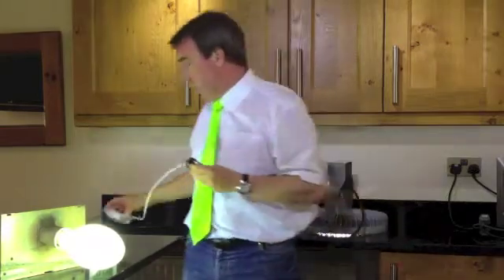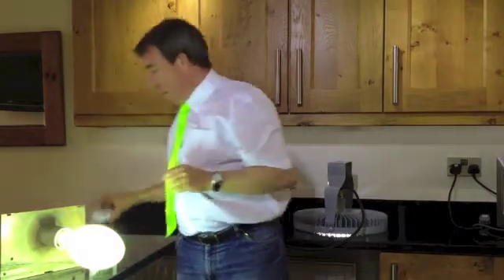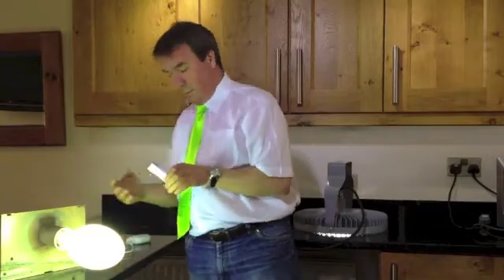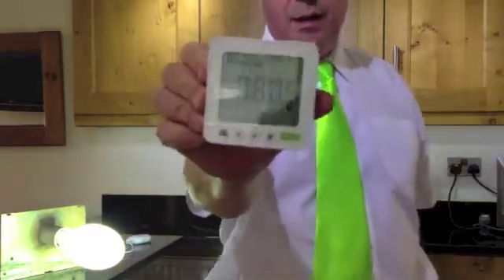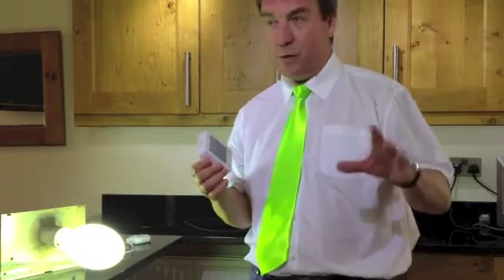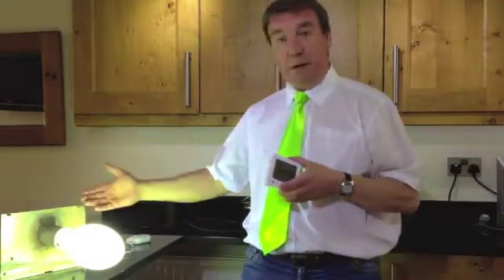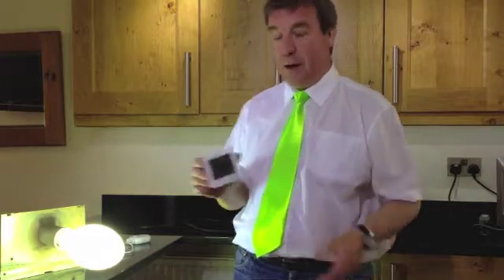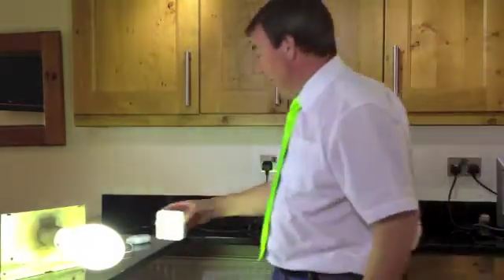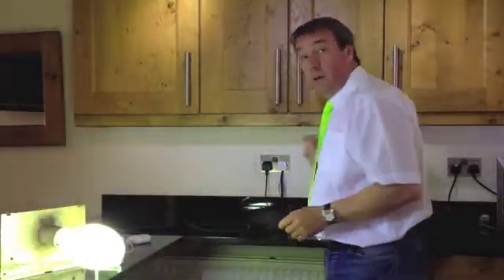This has been on for a couple of seconds now. Clamping the meter back on. Still burning 800. The best it gets to is 550. When we're doing the quotations, we always work on 400 for the lamp and another 10% for the ballast — so 440. And as you can see from my figures there, 805 down to 140-something for this one. We're absolutely well in there.